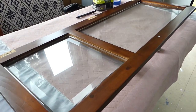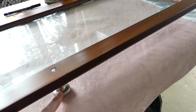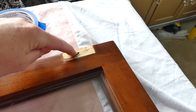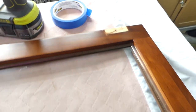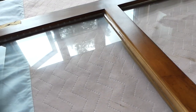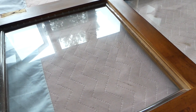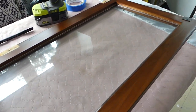Now we will start working on the doors. We're going to remove the metal pieces for magnets, the handle will come off, and we'll secure the hinge holes with tape so we don't paint over them. Also, very important: when you take something off, make sure you give it a description of some kind so you know where each piece should go back. When taking something off, you want to be able to put it back in exactly the same place.